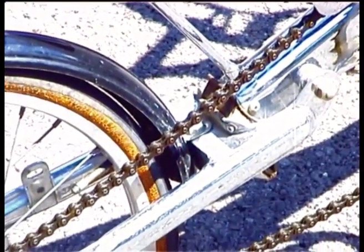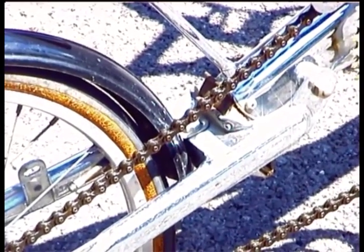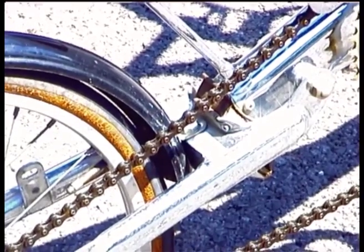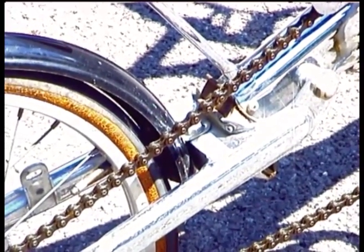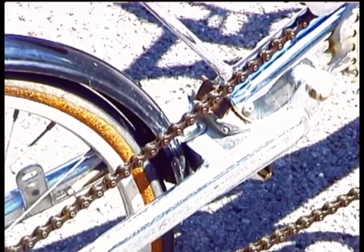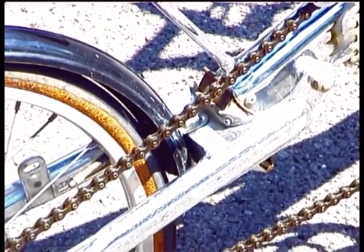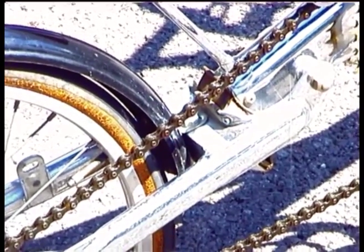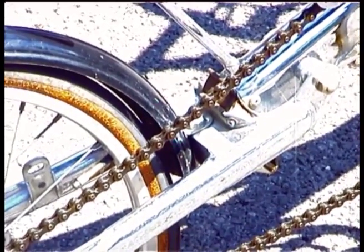So what happened was that the rubber was squeezed and sheared at the same time, and that gave it an increasing rate. In other words, the rate of spring, to put it in crude terms, got stiffer as the load increased, and this was self-compensating. It's one of those reasons why with an early Moulton you never seem to hit the stop on the rear suspension. It's a very nice characteristic, and in many ways the heavier you load them, the better they ride.